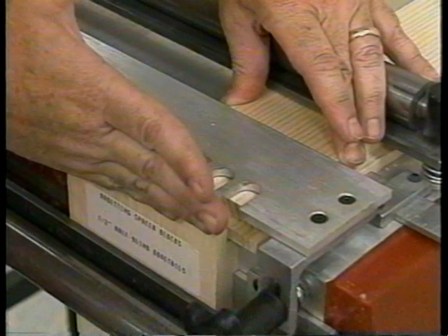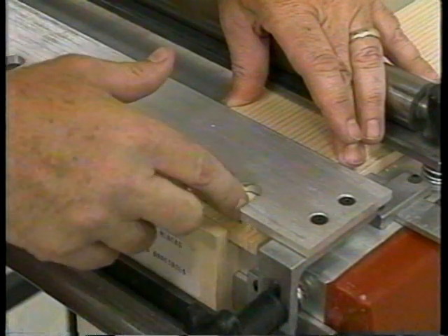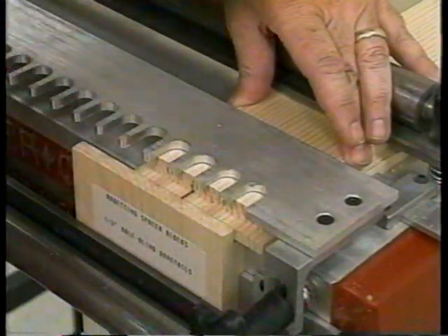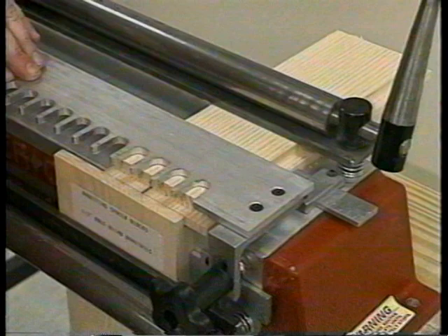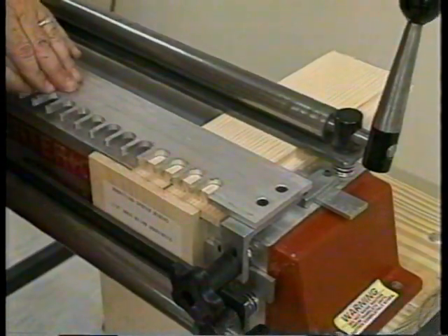You notice that this brings the entire piece of material three-eighths of an inch farther forward, bringing this edge on your original cutting line. Lock this in position. When you cut your dovetails now, you'll cut the proper depth dovetail for your rabbeted drawer front.